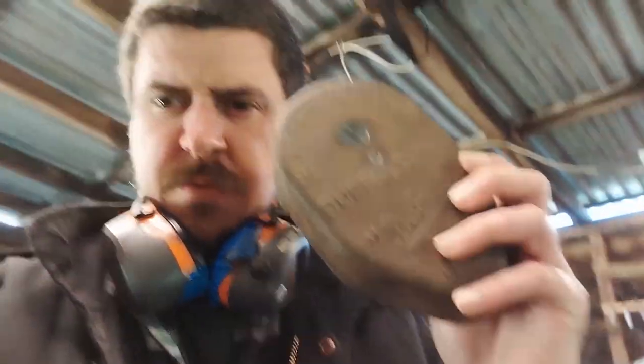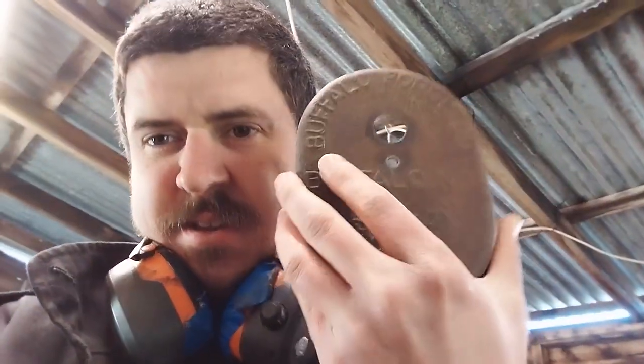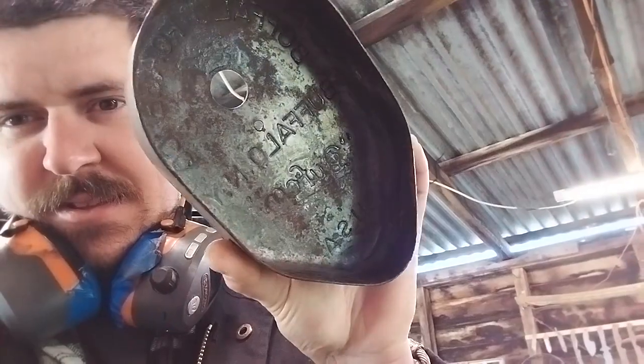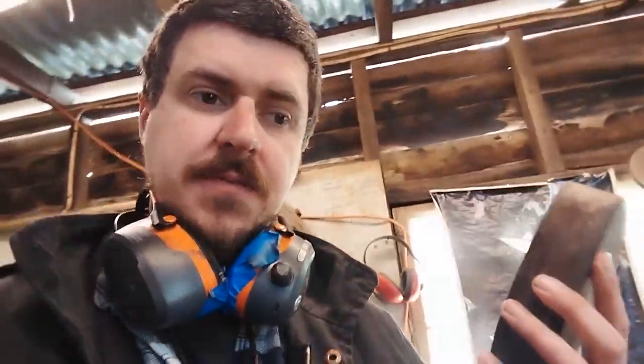So these are all done now and largely dried off. You can actually see this was exposed to the elements and this was covered in grease. The preservation difference is incredible. I was going to oil these with WD-40, like I said before, to get rid of any excess moisture, but since I'm going to be painting it, I'm going to use a heat gun to get rid of excess moisture. I'm just going to make sure that it is baked, basically, so there's no moisture left, and then it'll start being ready for a bit of painting.